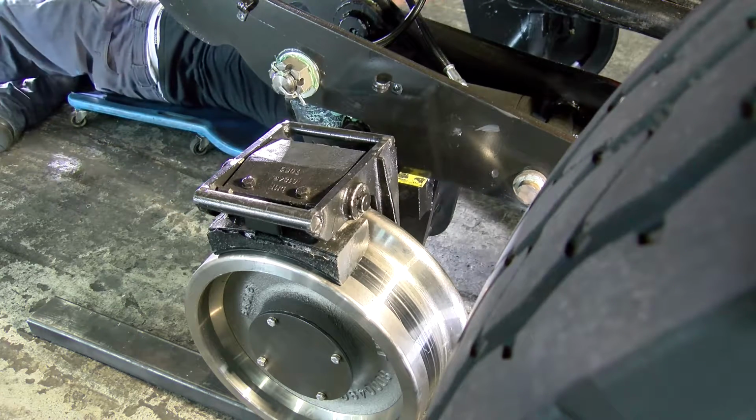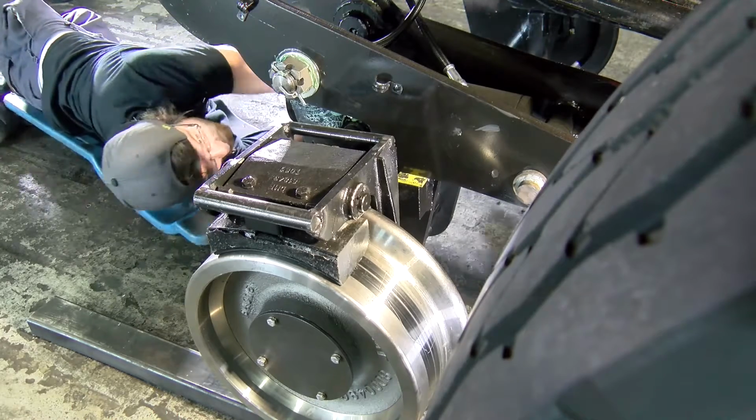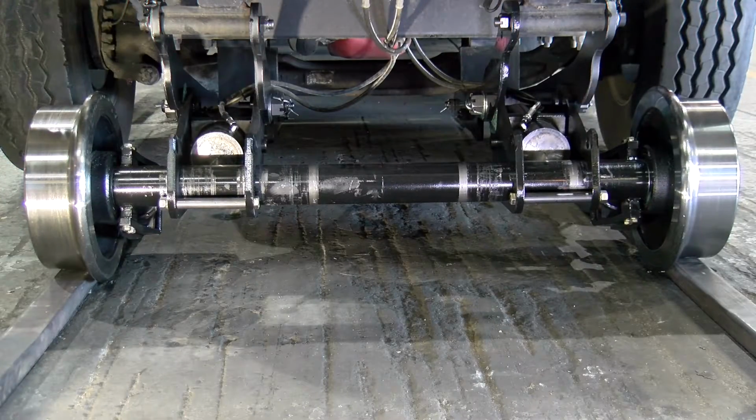If pivot arm shims cannot correct the rail gear alignment, then the front axle tubes must be ground free from the pivot arms to enable sliding it left or right on the truck.